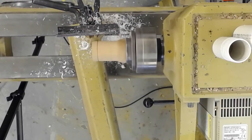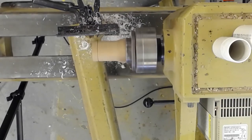The other thing is keeping this thing sharp. Where's my... I have a little leather pouch with a sharpener. Anybody see it? 600 grit. Got wax on it now, but when you sharpen it, you want to sharpen the top surface of it. So basically, keep it sharp because that's doing the cutting.